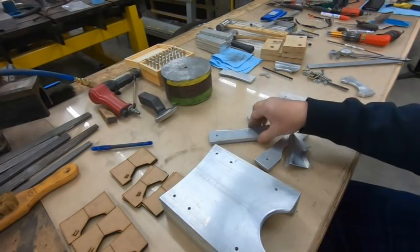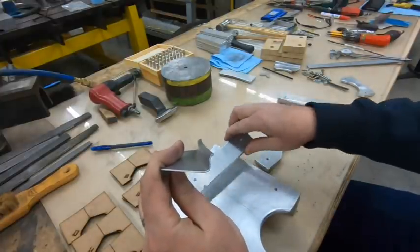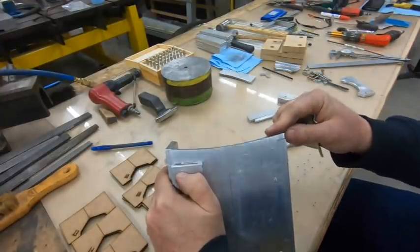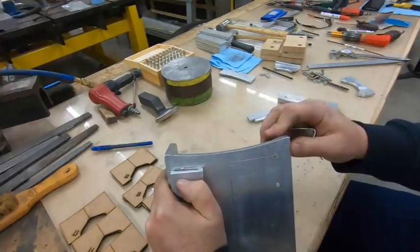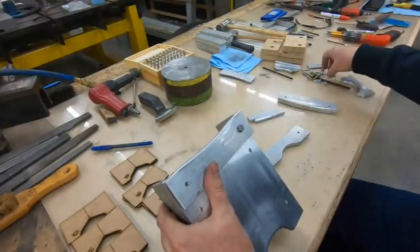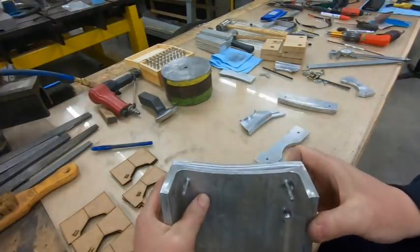The first bend is basically to bend 90 degrees — just that vertical leg — and that is of course off of this form block. I use this fixture itself. I've cut a relief; you can see it's a curve here. I kind of cheated on this because I didn't want to have to cut multiple backing blocks. This is the largest relief — it supports it very nicely and it'll support all the shapes. The piece of material will go in here and I can now bend over that form block with blows this way. I'll show you in a minute how that works.